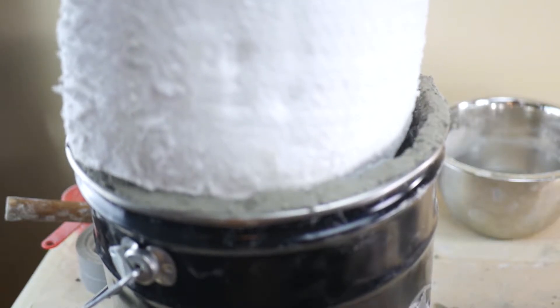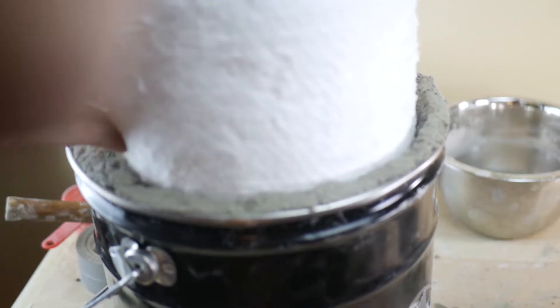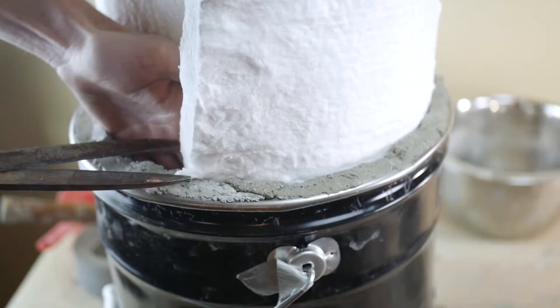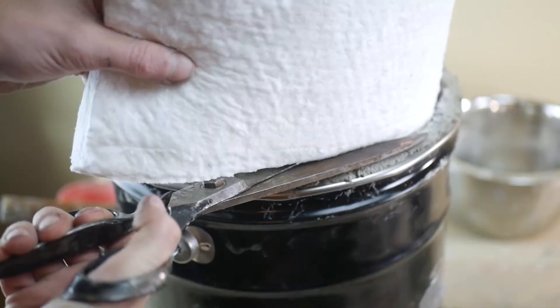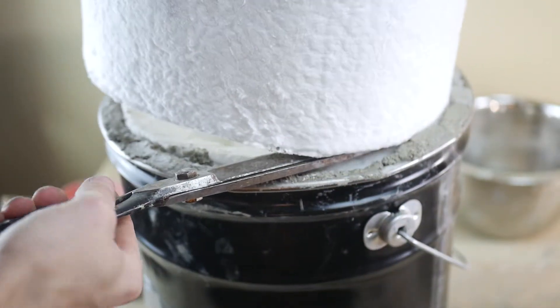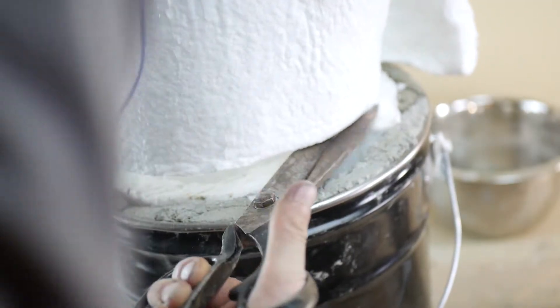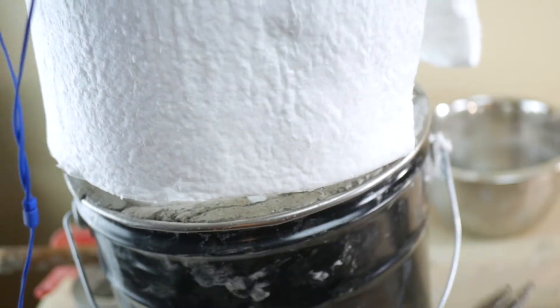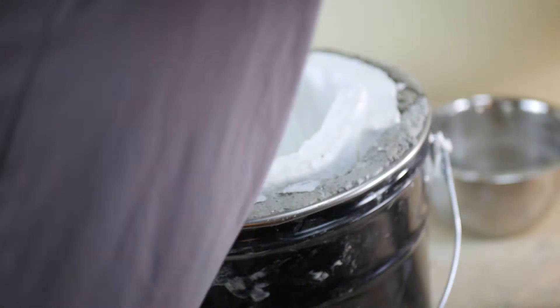Here's what I was talking about earlier with the double liner. This white insulation is called kaowool, and it's far cheaper and easier to work with than refractory cement. It's equally efficient as an insulator as well. For a small furnace you want as much insulation as possible so you need less energy to melt metal. This double lining technique will allow you to burn at over 2,000 degrees with just an everyday consumer propane torch.